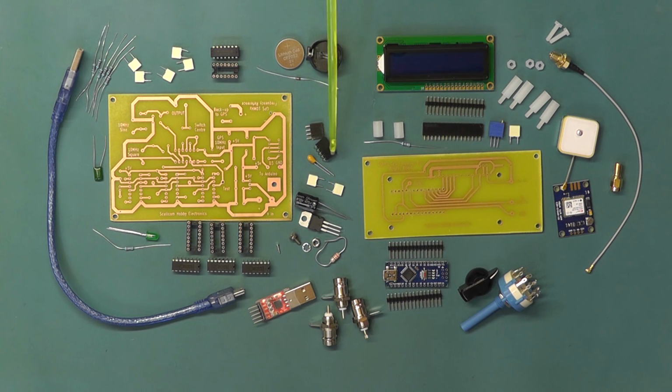That'll have a little sideways 5-way inline connector. There's the components there for the 5-volt regulator power supply. The main divider ICs are there, and the Hex-Schmitt trigger IC is there with its holder. These are simply just decoupling capacitors, 100 nanofarads, around the board, 100 ohm resistors which we'll use on the outputs, and that's the 0.01 microfarad capacitor feeding the input from the GPS module. Here we have the little button lithium battery there, 3-volt battery with its battery holder, and the blocking diode there. That'll go in that area of the board there.